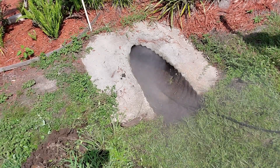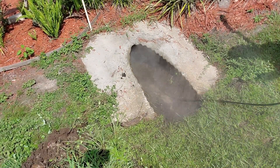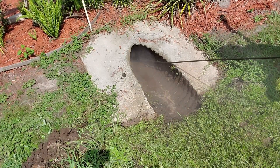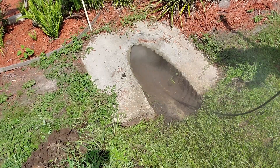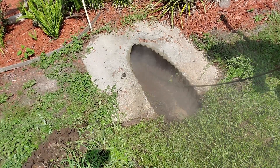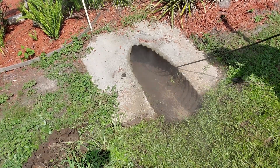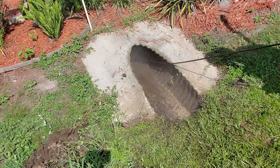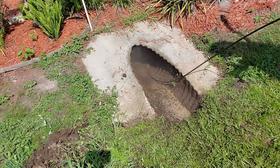If you remember how the mini jet works: it has a cutter nozzle with a very strong jet right in the front — one jet — that cuts through the sand and debris. Then there are four more nozzles at the rear that pull the water backwards. You can see as that jet goes through there it's pulling all that debris out, and I'm pretty sure we'll get this open in just a few minutes.